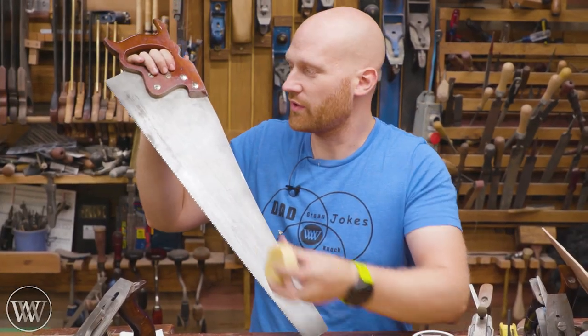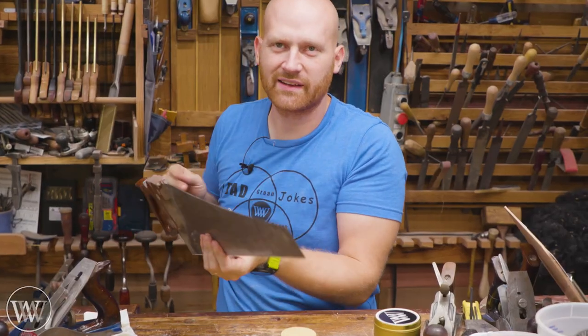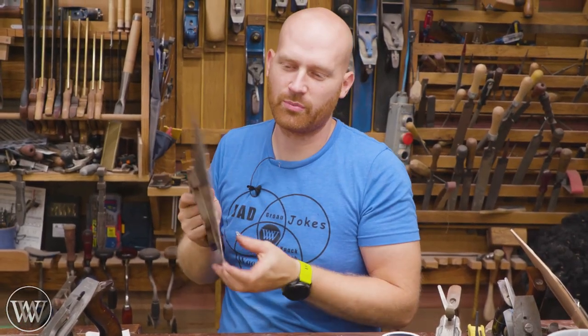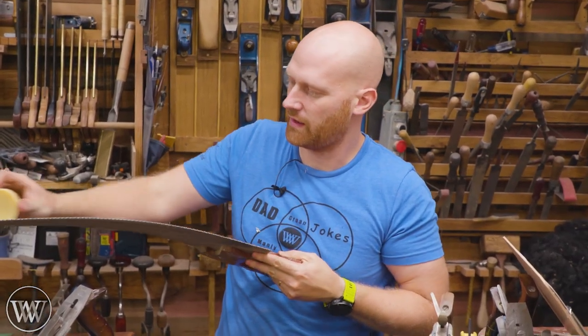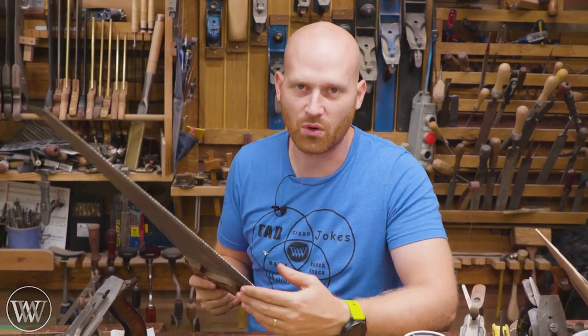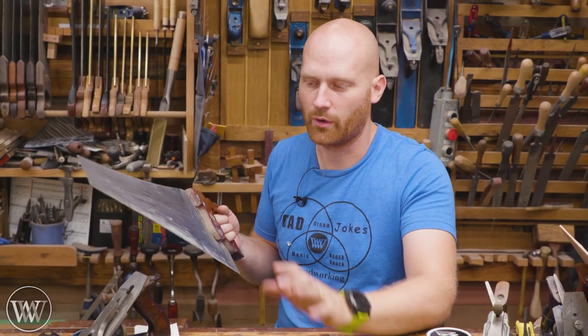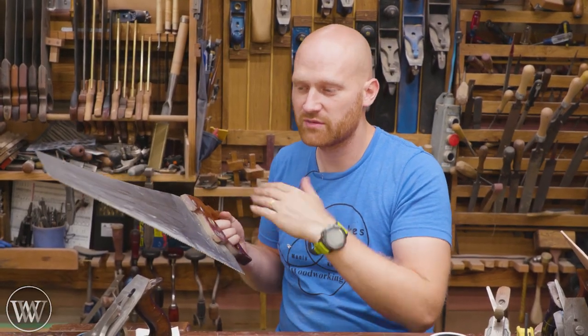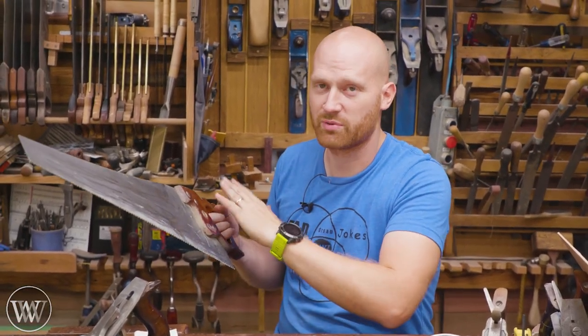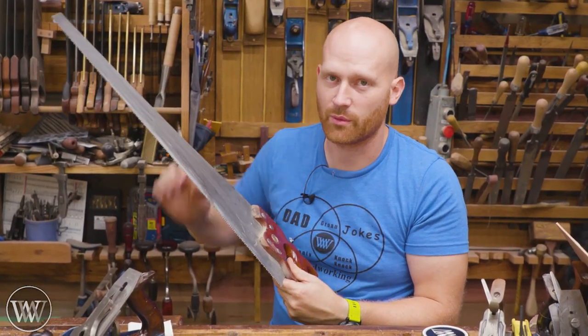The other place where I use it all the time is waxing saws. If you've ever been working with a saw and it's binding in the cut and getting harder and harder to push, just take a couple strokes of this and wipe it down either side of the plate. It is amazing how fast it suddenly cuts — it just slides through the work and makes the saw work far easier. It's less you're pushing into it and more you're letting the saw do the work. A little bit of wax on the saw helps it move faster as well as preventing rust and protecting the saw.